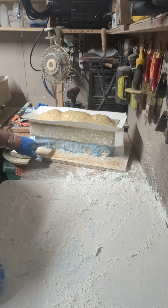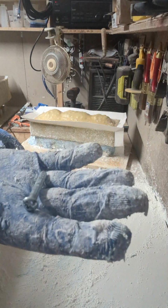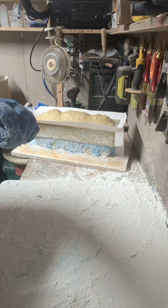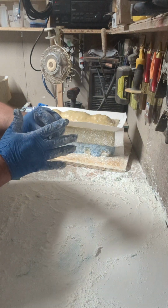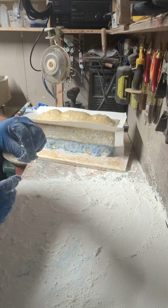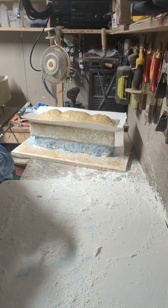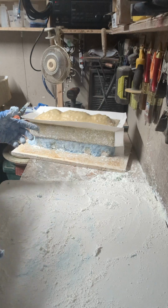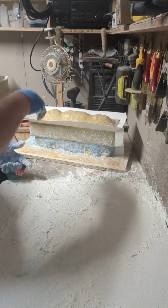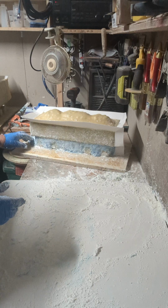Sometimes what I'll do is I'll put a screw, like a machine screw, like a stove bolt or whatever you want to call it, like that. I don't know if that's going to show up or not. One like that, and I'll embed it into it and squish it around, leave the thread sticking out, and I'll put my fiberglass over it, and then I'll clean it up very carefully. That's a bit of a pain. Put some tape around it, makes your life easier, and that allows me to bolt this in place inside the mother mold. Don't usually have to do that. It's very rare I do that, but once in a while it comes in handy just to keep things aligned. In this case, when this is filled upside down, this will be the last thing sitting in, so it'll hold its proper spot without any problem. It's not going to be overly heavy.